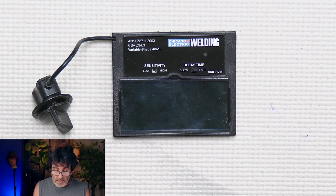So I have a better way to do this. Instead of re-soldering the batteries on the board, we're going to make an external mount for the batteries. That way, the next time the batteries go bad, all we have to do is pop the thing open and replace the batteries, and that's it. Very simple.